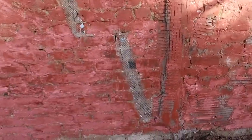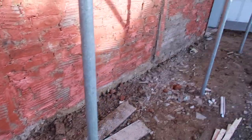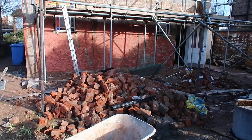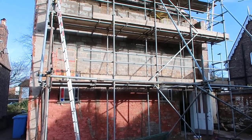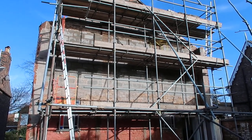That's my wire cable in. All this has now had the render grip applied, as you can see. Let that dry six hours and then it will take the next coat. That's the bottom bit where it's really deep, and then we'll PVA with a special SBR and go on top of that for later. That's the next job — putting the first coat on.